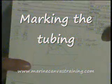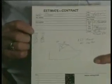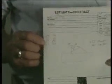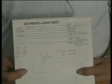Inches, and we're going to have a 52-inch mounting point with a 45-inch layout. So what we did, in order to make an intelligent estimate, we added up those figures to see how much tubing we had to charge for. And if you add up these figures, which are used in conjunction with the formula with the bender, we found out that one length of tubing was 133 inches, and the other one was 83 inches.